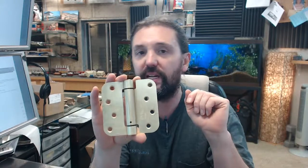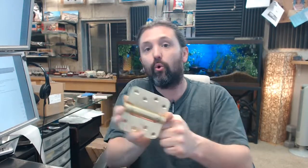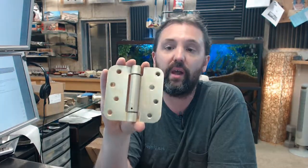Now the 5/8 radius is very typical that you're going to see from a wood door shop, someone who manufactures or assembles wood doors and frames or pre-hungs. 5/8 radius means it's a 1.25 inch diameter router bit that they're using to quickly cut, and maybe even in a very automated fashion, the hinge preparations on both the door and frame. A 5/8 radius hinge allows the door manufacturer to not have to go back and square those corners out, which is typically a hand sort of process.